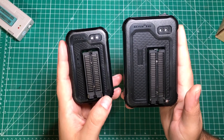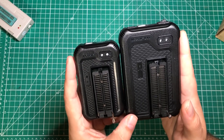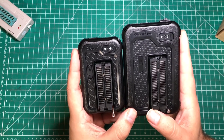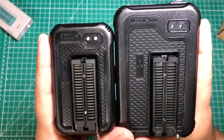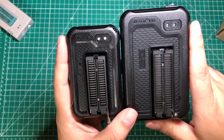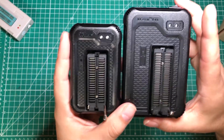The T48 base unit is between $50 and $70, while the T56 starts at $170 without any adapter — so you're talking real money. For that price you get a heavier-duty unit with the ability to program 33,000 chips, largely due to the extra pins supporting longer PIC microcontrollers and 48-pin chips. These things can also program Arduinos — take your ATmega 328p chip from an Arduino project and clone it. There are just all kinds of wild things these devices can do.